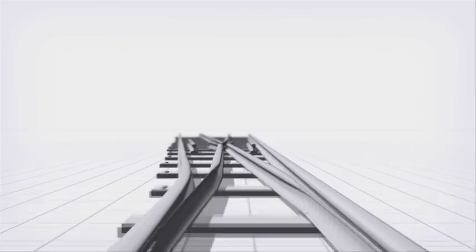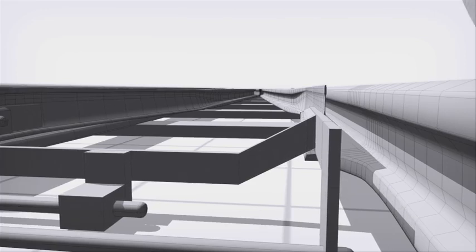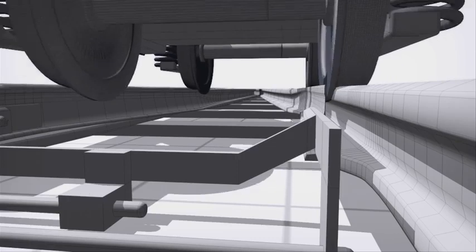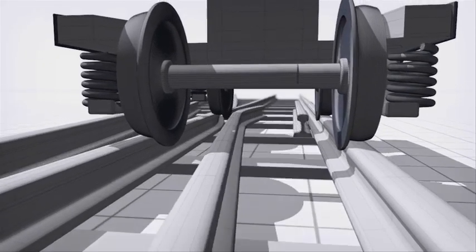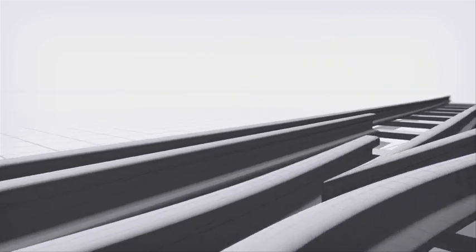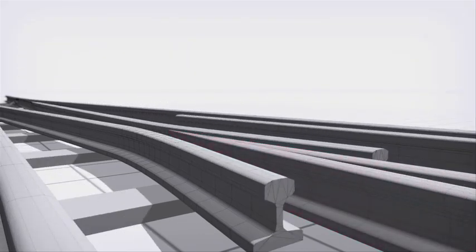This is how it works. In normal mode, the left-hand wheel rolls along the switch rail and there's flangeway clearance for the right wheel to continue along the stock rail. The inside surface of the right flange is kept on course by the check rail. This restrains the wheel set and ensures it is directed along the correct route. Meanwhile, the left wheel transfers contact between the different parts of the crossing — that's where there's a high impact load.